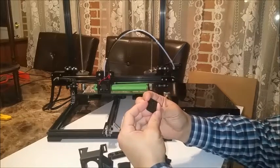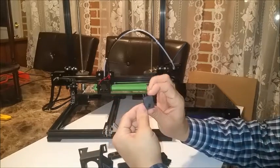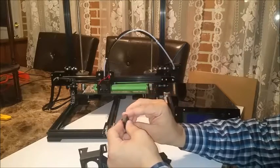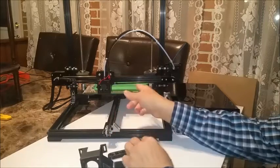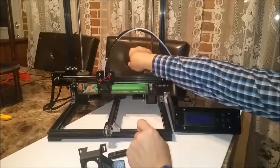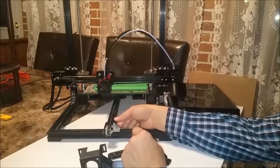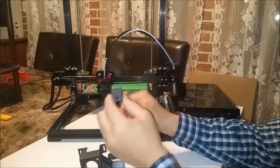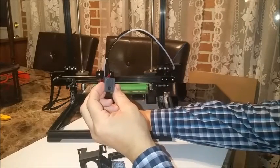I also designed this little block, but I'm going to modify it I think, because I wanted a spare and a replacement for the z-axis end stop. But I also want to do something for the front - so if I ever want to switch up my y-axis end stop so my bed comes to the front when it's in the home position, instead of going to the back where I have to reach through to get my part. I was thinking of having the ability to wire my y-axis end stop out there somewhere, but I might wire that up a little differently. But that there is still a spare replacement component for your z-end stop mount.